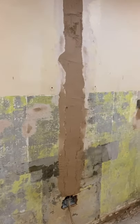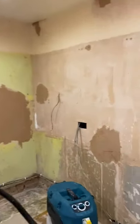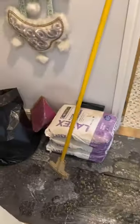So there you go — you can see some of the channels have been filled in, bonded. All the first fix electrics have been done now. Hoover's on the go getting all the floor clean and dust free, and then we'll start the latexing. Now that the floor's had the latex, we've got two more coats put on top of this just for that finer detailing. All the electrics are in, first fix plumbing's done, and the walls obviously have been skimmed. So tomorrow, once the latex is dried, we'll be getting the flooring down. We'll include that in the video, and then we'll be on to fitting the kitchen.